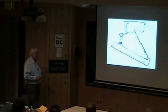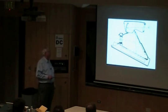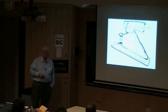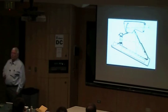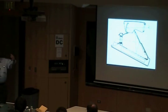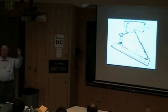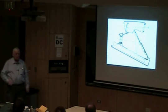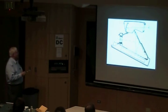Now you want to see it. And that requires turning the image right side up and presenting it to the eye. The light that's regrouped going through here hits the concave mirror, and it gets re-imaged in this place in space. Now let's suppose for a moment that the concave mirror is an old-fashioned spherical shape. You get a pretty decent looking image, but it's got a problem. The problem is it's supposed to be a pretty square, and the top corners are all mushed down. Very bad case of distortion. So that's not good.